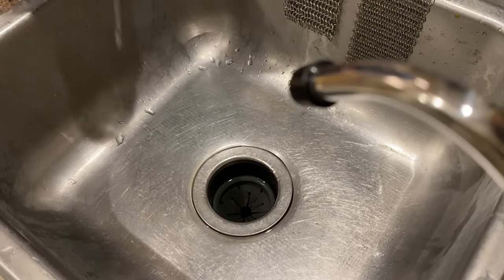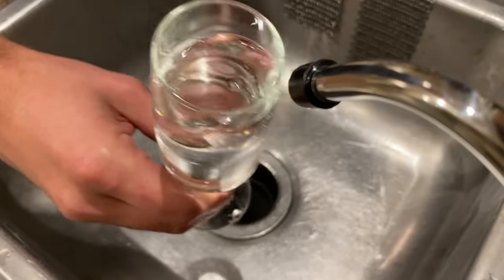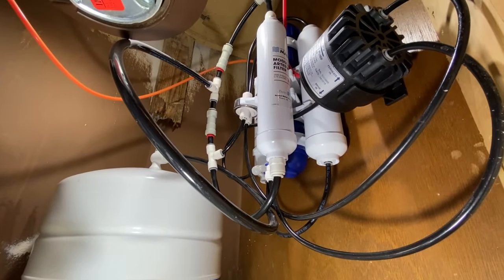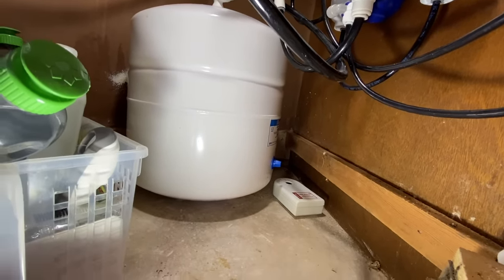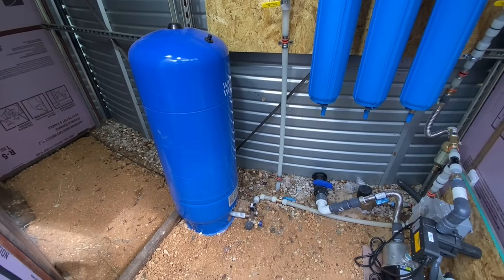In my house, there is a strict rule that we only drink or cook with water coming out of our reverse osmosis filter, also called an RO unit. The RO filter inside the house filters down to 0.0001 microns, which is smaller than the smallest known viruses, which are about 0.02 microns. If you don't have the same RO filter rule in your house, you should add an ultraviolet sterilization unit to make sure that any potential viruses are killed before they leave the pump house.